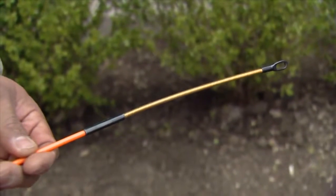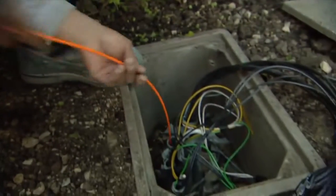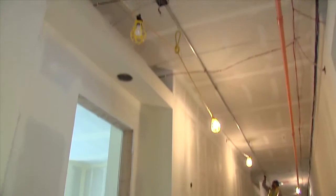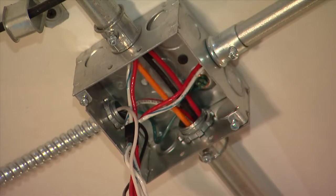To help navigate those complex conduit runs, each Klein Tools fiberglass fish tape comes with a flexible spiral steel leader. The leader is the key to that fish tape, especially compared to steel fish tape or other fiberglass tapes that don't have that seven-inch leader on it. So every time you get to a junction box, instead of going straight through, it always goes off course. We had about a 150-foot run with probably about 10 to 12 junction boxes in it, and we were able to start at one end and just push all the way through every single box and get it to the end.